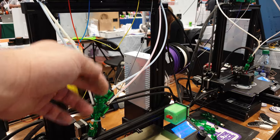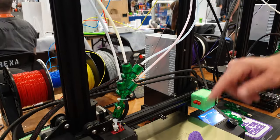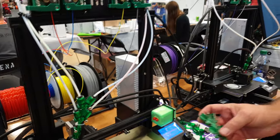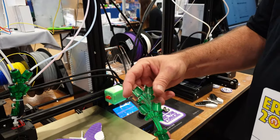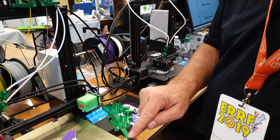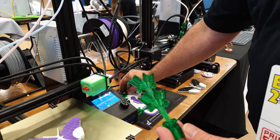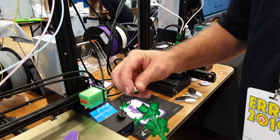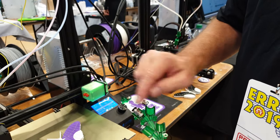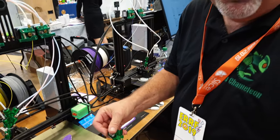It's like just another type of splitter in front of the other splitter. For the four-color, it's a dual stage. This is a derivative of the CME CNC Y-splitter that they originally had, but we added a second stage to it, and we also changed it to the more common PC4 M10 screw fittings to make it cheaper to manufacture.